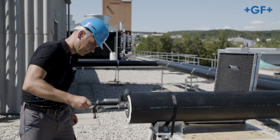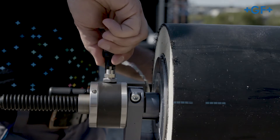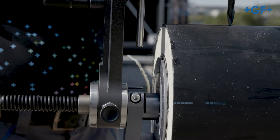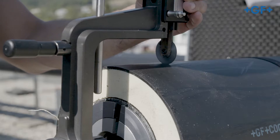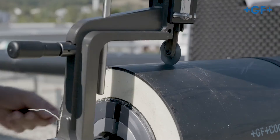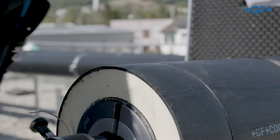At the same time, the insulation is detached and the oxide layer of the inner pipe peeled. Now unlock the locking bolt by pulling and turning at 90 degrees. Press the circular blade holder onto the pipe and adjust it on the lever with one to two clockwise rotations. Now turn the peeling unit once clockwise and adjust the feed lever by a quarter turn.